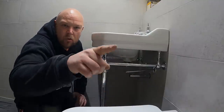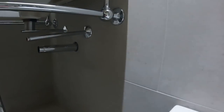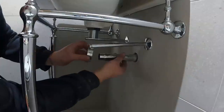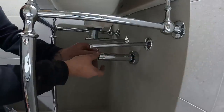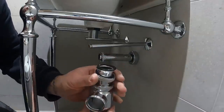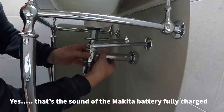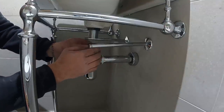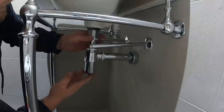This is where it comes down to where the work was done in the first fix. If I just pop the camera on there — this is the waste. Let me slide on the shroud first, it's going to cover that back bit. Obviously that's going to push right back to where we need it to go. Pop that one there with the washer, and then this little washer here sits into there. Then we can put that in. This is where it all lines up as per the first fix — that's why, like I said before, you've got to take your time and make sure everything just lines up. Plan it all out in the first fix and it makes the second fix a hell of a lot easier.